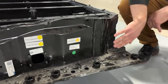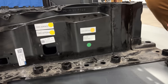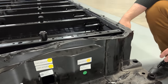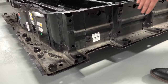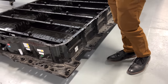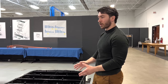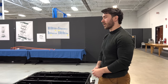There's quite a high component count here. Typically in something of a similar geometry, we'd usually expect to see a front piece where there's more complex geometry — some curvature might be cast aluminum — then running out to side rails made of an aluminum extrusion. But here, every single bit of this is stamped steel. There would obviously be a cost advantage to that. You have to do a little bit more processing because there's so much welding going on. Throughout just the housing itself, there are over 3,500 welds of one form or another. The processing cost is going to be quite high, but steel compared to aluminum, you are going to have a cost advantage.